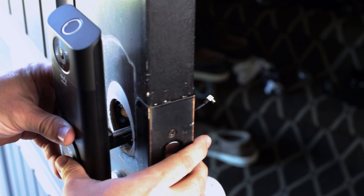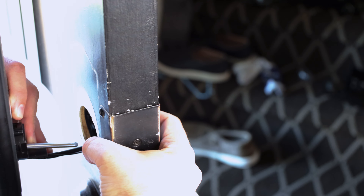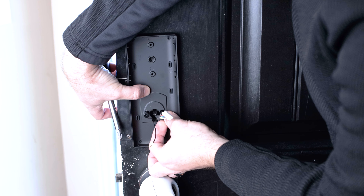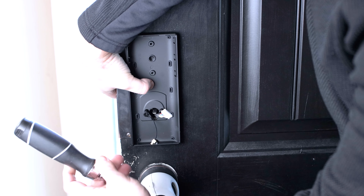If you need to modify the strike plate, remove the two screws, take it off, and place the new strike plate on the doorframe. There are two color options — silver or oiled bronze. Make sure to use the long included screws to secure the strike plate; most security experts recommend longer screws if possible. Now take the outdoor unit and slide it through the hole, ensuring the two cables can run inside without getting pinched, and that the rotating shaft passes through the deadbolt hardware.